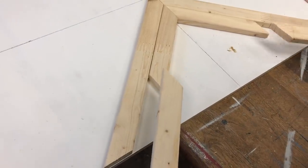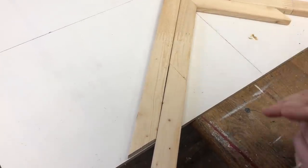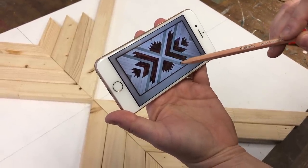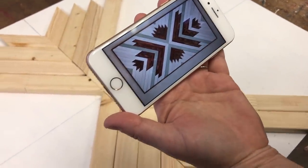I have the remaining cut-off pieces from those longer boards, and I can keep the 45s that were already there, line it up, make my mark, and then cut. I'm following a reference photo online for my pattern rather than drawing my own for the first one — I know exactly where to piece each section. To make the arrow section, I cut the pieces to eight inches, the middle ones to six, and the small ones to four, giving a gradient down in scale.